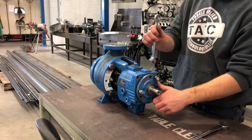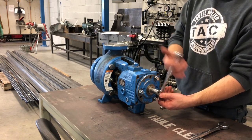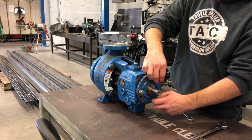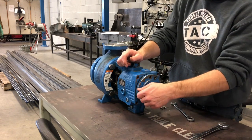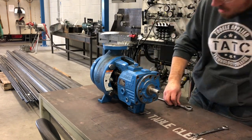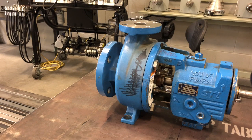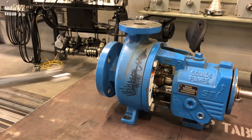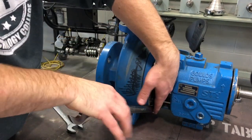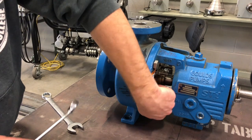So what we're going to do next is I decided to loosen up the bolts on that back plate first. I felt I just wanted to get them out and onto the table so I didn't have to deal with them later, and then I went ahead and moved up towards the front. The part that has those two flanges connected to it is typically called the volute or the impeller box — that's pretty much where the impellers house and all the water or material that you're pumping flows in and gets pumped back out.